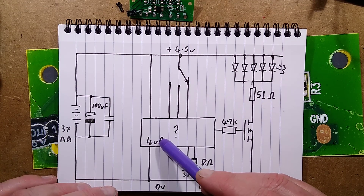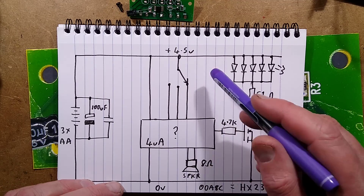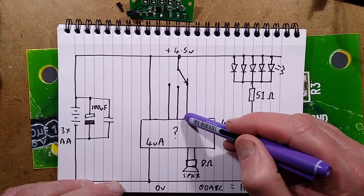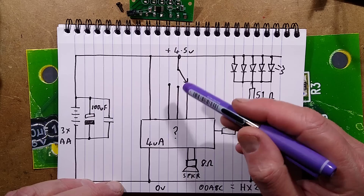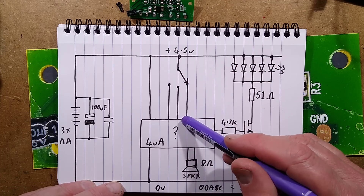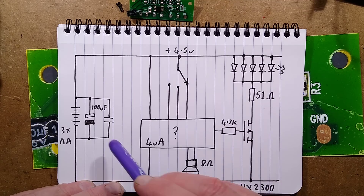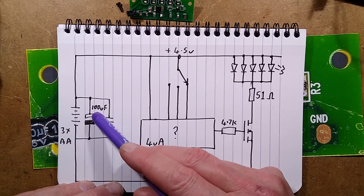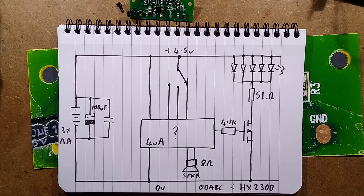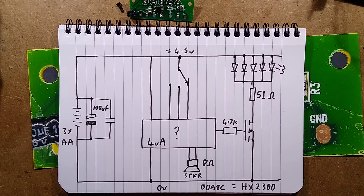Mystery chip. Its quiescent current is 4 microamps, which is just as well, because when you put batteries in it's directly powered at that point. There's the switch that controls the mode — it switches between three positions on the positive rail: one of which is off, one of which is the storm mode with the lightning effect, and the other is the strobe mode. I wonder why they've got that off position. The 4.7K resistor goes out to the MOSFET, the 51-ohm resistor, the LEDs, the little ceramic capacitor, and the electrolytic just dabbed across the supply from the battery pack. Very strange circuitry — the fact that the off position actually connects the positive to a logic input to tell the chip it's off is unusual.